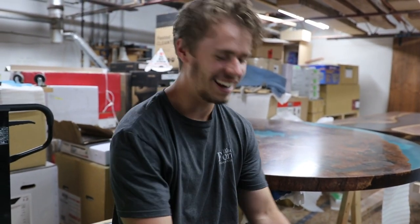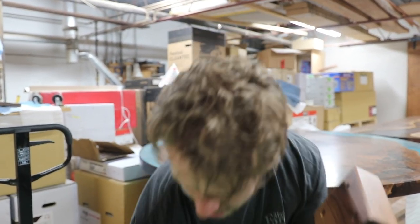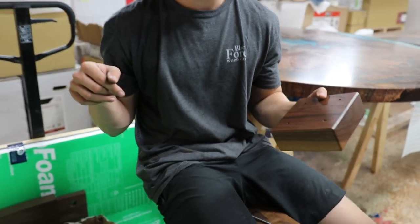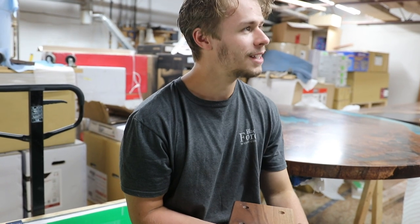okay, we were kind of scared this was going to happen. Our drill press wasn't really working properly when we went to drill out these blocks, and that means we had to drill them by hand, so they're not 100% accurate in the same spot, which means they actually don't match our plates. I guess we need to make new blocks.